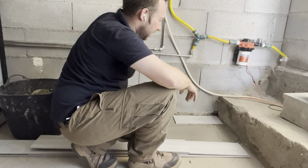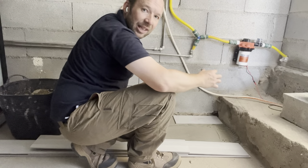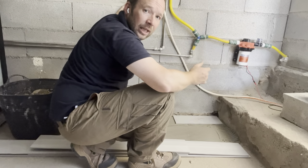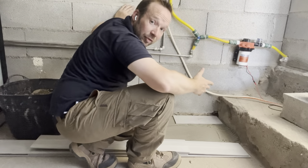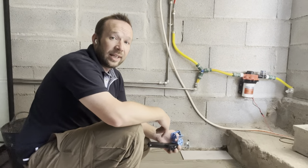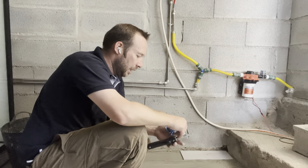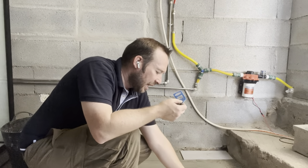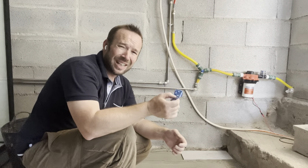When you're actually doing this, they advise you to leave a gap around the edge and fill that in with silicone or caulking. That just gives room for expansion — it's a typical process. We've got a tile there. We've got the three mil spacers, and they say three mil should be kind of a minimum when doing floor tiles.